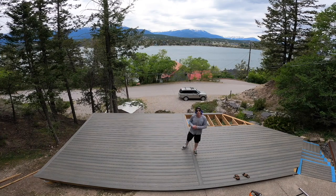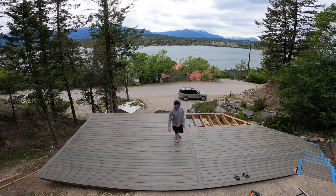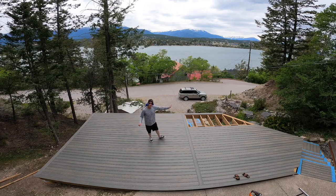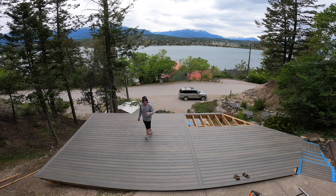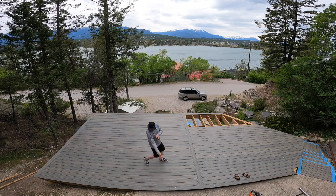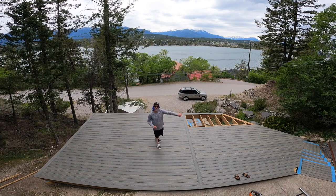I think I'm going to start with the 25 foot section across here because that's 23 feet. And I know that that post will be wrong. So I'll get an extra post out and probably have to put it there and cut the rails. So that's my thought. Then I'll use the 29 foot section to come across here. And then I'll use the 13 foot section to get from here to like here. And then I'll have some scraps to see where they go over there.